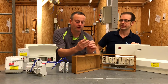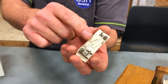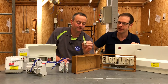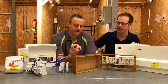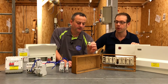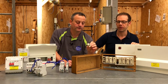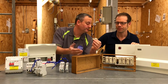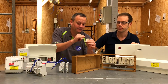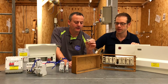Keep that away from me — we've got a little layer of asbestos in there, which is obviously deeply worrying because it is highly lethal to human beings. It's there just to damp the arc, to contain the arc when the metal fuse wire blows. Obviously if you come across one of these in the wild, that's not something you want to be messing around with. What happens is a piece of tinned copper wire — smaller than the actual conductor — is strapped between two points. In the event of excess current, you melt this piece of copper rather than the copper in the conductor, and the asbestos holds that energy and allows it to melt away.